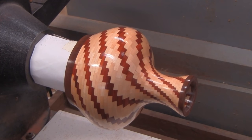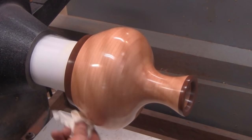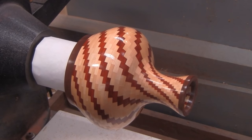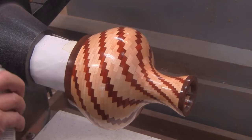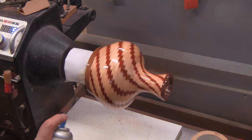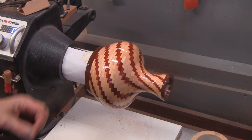It's 41 degrees outside right now. I've been running my heater for quite some time, and prior to putting more on I've been rubbing a paper towel over there to try to heat the wood up just a little bit more. So now we're going to put a nice coat on and hope that it doesn't run. I'm probably going to do this two or three more times — Scotch-Brite in between each coat, maybe wet-and-dry sanding. When I come back I'll do the final treatment and show you how I'm doing that.